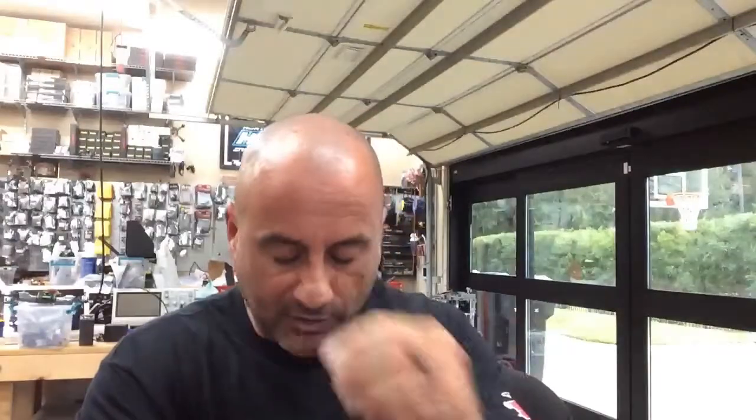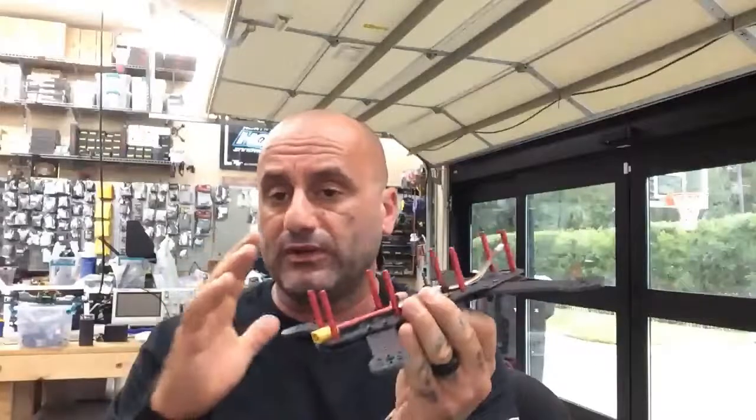Hey guys, Targo Cyclone FPV. We are now doing part three of our Grand Oaks High School Drone Club build for their drone kit. Today we're going to be doing the motors. I'll do one motor and show you what we're talking about, maybe do two motors in this video. All four are done the same way. On part one we assembled the frame, on part two we prepared the ESC, and on part three we're preparing your motors and showing you how to measure them and make sure the wire lengths are done properly.